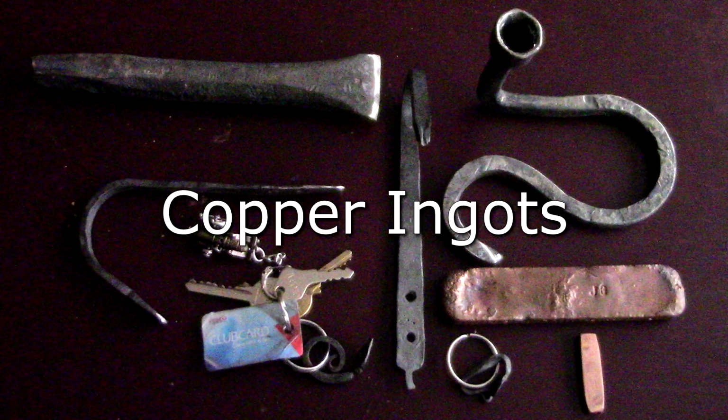I don't know what the original item was that I made it out of, but it's some sort of strange object I got in my scrap buy, which had two ends which looked like screwdriver ends, and then a round rod going through the middle for a few inches. So there was a bit of stretching out of the material to make them longer into these coat hooks, but the actual item itself was fairly close-ish to the sorts of dimensions I needed already. It was just a matter of doing the flattening and then the stretching out to make the actual sort of pinning ends here with the holes, and then the hook ends at the bottom.